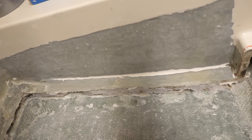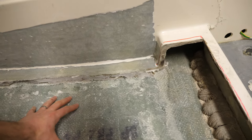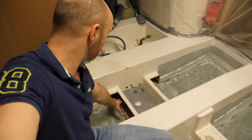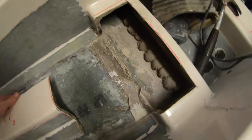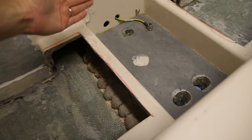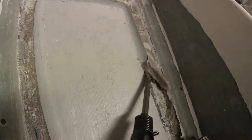Under there you can see the bonder underneath the fiberglass — that's what bonds the glass to the bottom of the hull and gives the boat its strength. What Patrick was doing is taking a belt sander and cutting down the tabs here, because they extend a little further out, to give easier surfaces to work with so he can bond the glass both to the grid and to the hull. He's also chopped away a piece of the grid so he can get inside, look at all the bonder in there, make sure there are no cracks or delamination. A useful tip: use an impact driver or a big screwdriver and hammer to crack away the bonder — that's much more effective than a circular saw.